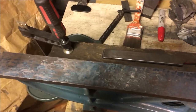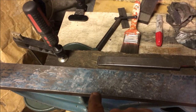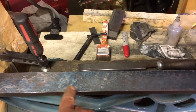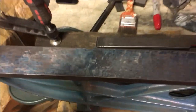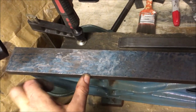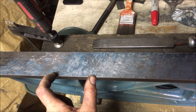And I'm no expert, I'm just learning as I go, but I do know that from the first time we're printing all to the right, this section will be riding up a touch on unscraped bit versus fairly well scraped. So you're always going to get some degree of error here, which if you look is why we've got the density of the blue in that area when we actually print it properly. So you've got 6 or 7 inches of the original unscraped surface, then you've got this 2 to 3 inch, let's call it questionable area.